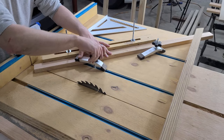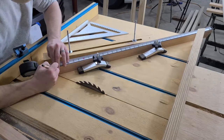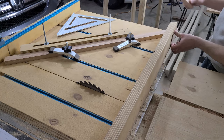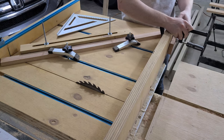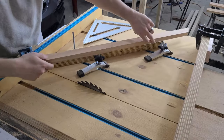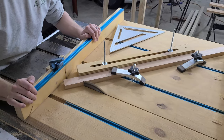We repeat this same process on our longer frame pieces as well with one minor change. After cutting the first corner, we need to figure out how to cut the second corner and have all of the pieces be the same size. Unfortunately, these pieces are longer than our block, so we had to get a little creative with the stop block. We lucked out and the pieces were just about as long as our crosscut sled. Using a small spacer, we were able to clamp a block to the back side of our crosscut sled and use that as our reference surface. We could have angled the blade and done these the same way we did the mitered boxes for our modern headboard build, but this worked out great.